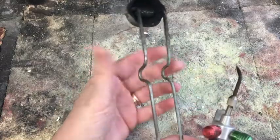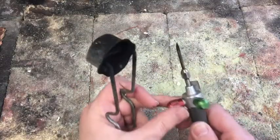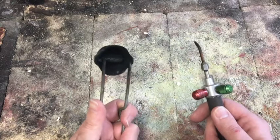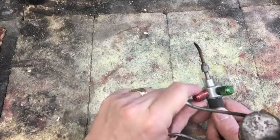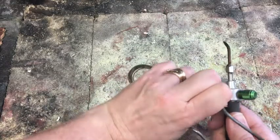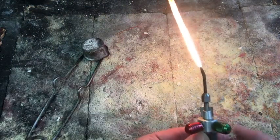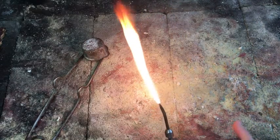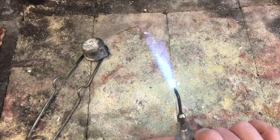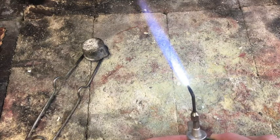You don't want to push down and across because it's going to get stuck. Push across and down just a little bit to get that strike going. Hold your striker in your left hand and hold the torch in your right hand — even if you're left-handed, start like this. Take these two fingers, turn the gas a quarter turn. I know it's a quarter turn when my top finger was on top and then it's on the left side. Quarter turn and strike. I lit the torch. Next, turn the gas up slowly. What we're looking for is what we call a cone — you're going to see it get really bright and white, and then there's a little blue thing. That's our cone.